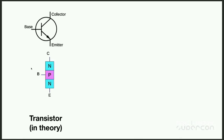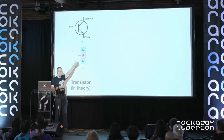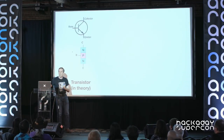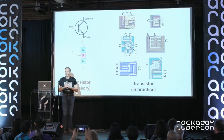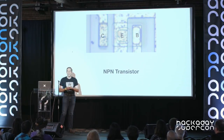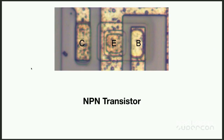Transistors are the key component of integrated circuits — they function as switches and amplifiers. For an NPN transistor you have an n-layer for the collector, a p-layer for the base, and another n-layer for the emitter. But when you look at an actual chip it looks totally different — the base usually isn't in the middle, sometimes you've got six collectors or two emitters. Looking at an NPN transistor from the 555 timer, we can see the metal layer, the wires connected to the collector, emitter, and base, and faint lines showing where different regions of diffusion have been done.